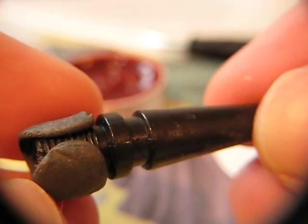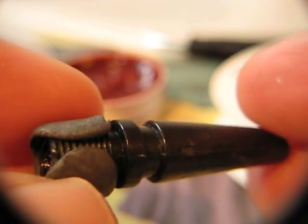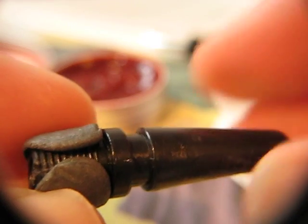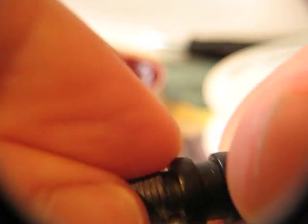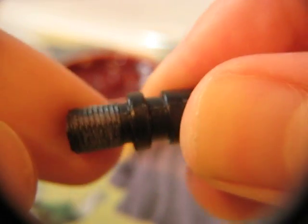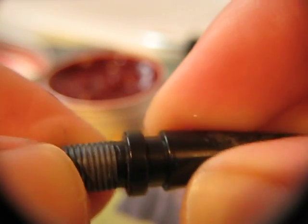Got the threads next. This was the deal breaker for me because it's a delicate material — it's injection moulded, there's a big ugly flash line across it, and the threads are very very shallow. I thought, if it can take an impression of these threads, it could probably do okay on the eyedropper — and it's done a fair job. It's slightly bulky as it passes the flash lines on either side of the injection moulding, but it works. The epoxy is also quite soft, which means it's not chewing up the threads, which is what I want — it's safer this way.